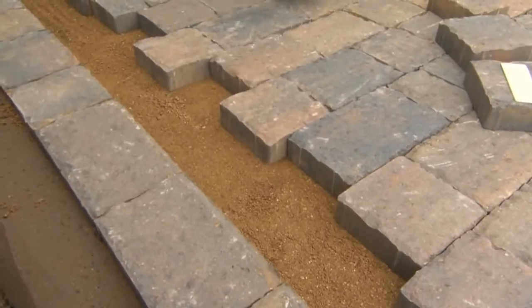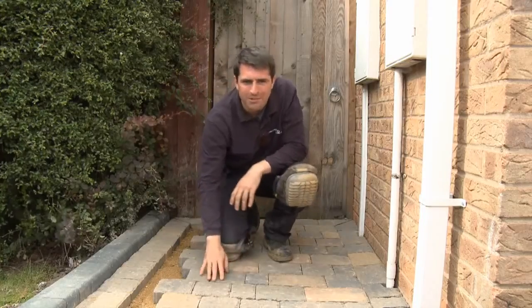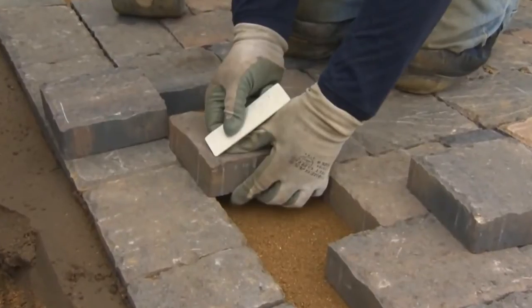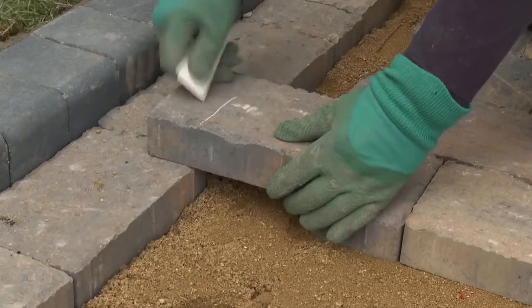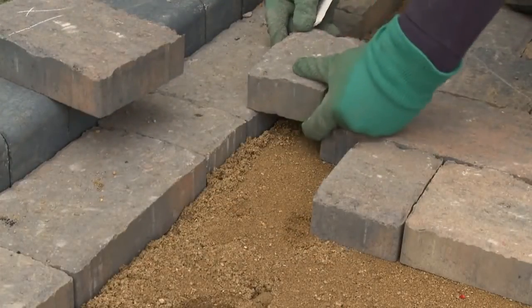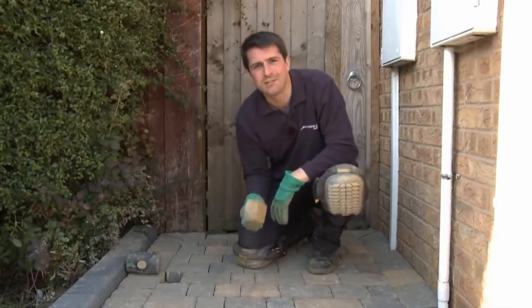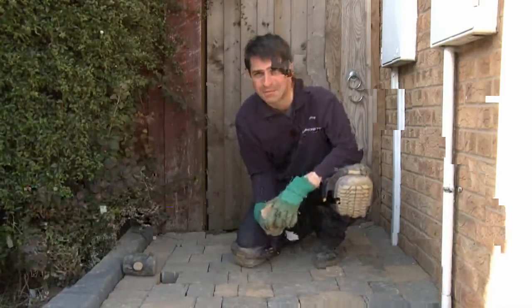And now, as you can see, almost all the driveway is covered with blocks. The only gaps are where blocks need to be cut and that will be our next task. With a fairly simple layout such as this course pattern, the cutting in is relatively easy. When blocks are laid at angles or where there are arcs and curves it can become a bit more tricky, but this is relatively straightforward and shouldn't take too long. There are three very different tools that are commonly used for cutting block pavers: a hammer and bolster chisel, a block splitter, or a power saw. It's best to leave power saws to the professionals, so you should either use a bolster chisel and hammer or block splitter. Cutting in can seem like a slow job after the mad rush of block laying, but neat, accurate cutting in can make the difference between a really good looking job and one that's a bit of a disappointment. Take your time, don't expect every piece to fit perfectly, and soon you'll notice you're getting better and better, and before too long you'll be fitting that very last piece.